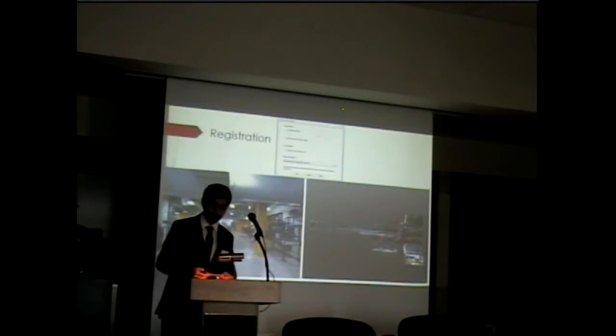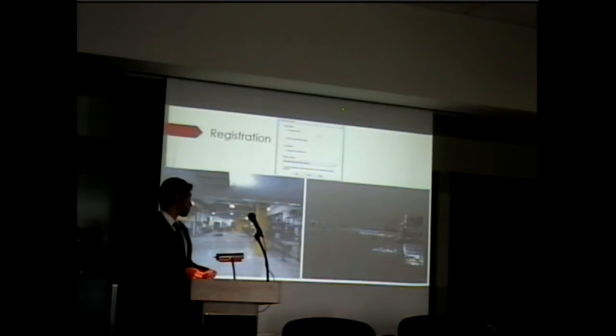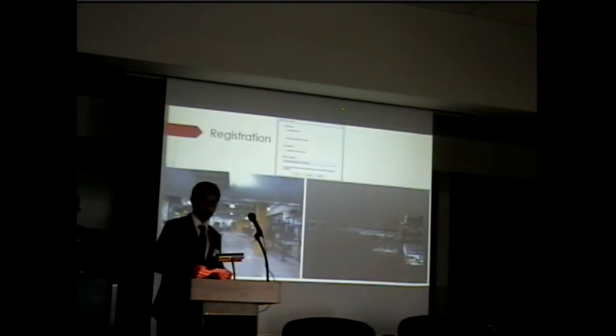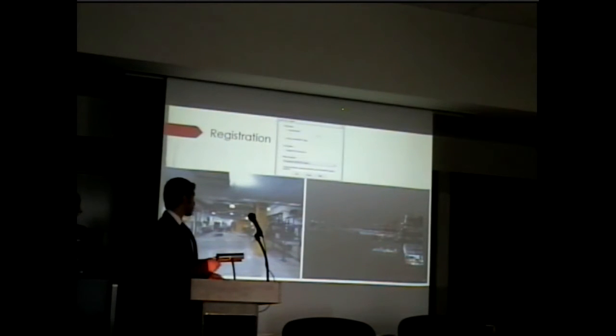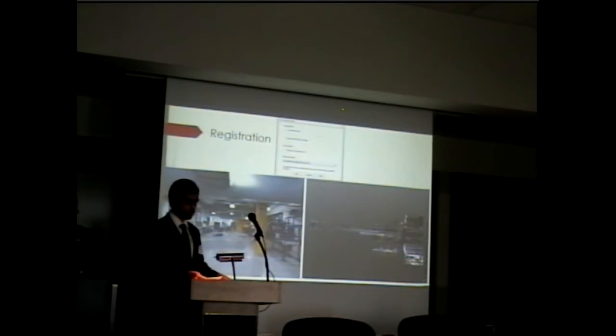The next step is automatic target-based registration. So we choose auto extract target under registration, and we choose our first station, which is the first scan, as a reference station, because it will not move during the process, and also because it is a central scan. After applying this, all the points are going to be organized based on the stations. And as I told you, the first station is going to be a reference station. This process takes around 10 minutes because we have a high number of points in the point cloud, which is 1.5 billion.